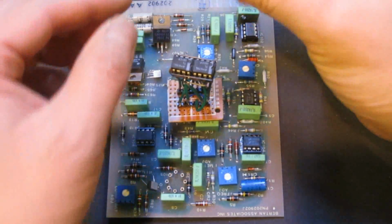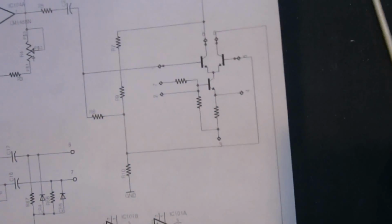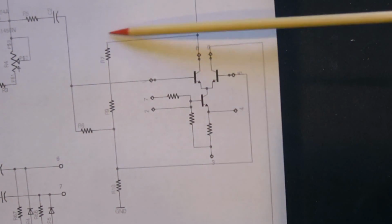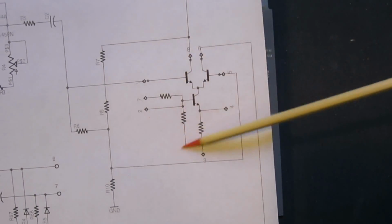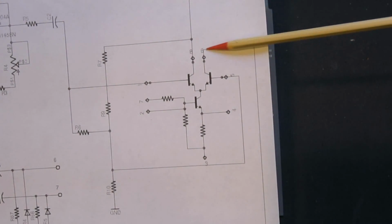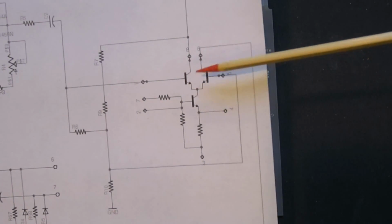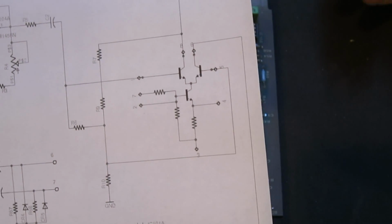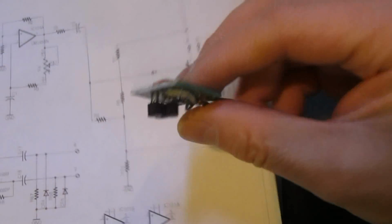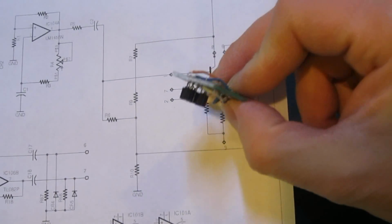That was just for testing purposes, and also for this Cascode amplifier. If you recall, last time I showed you the circuit diagram, where I deliberately drew out the Cascode amplifier, so you can see it's rather simple. Of course, for this integrated circuit, these two transistors have to be matched exactly for the performance. But for me, I just want to test whether the whole thing works or not. So I ended up with this rather crude construction of the Cascode amplifier.